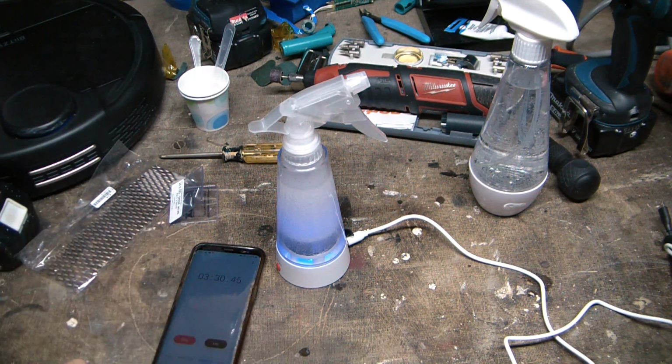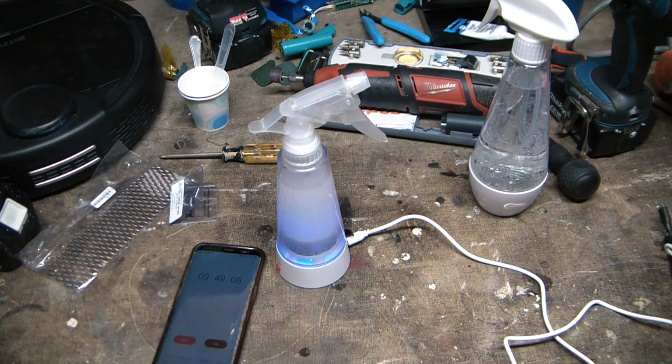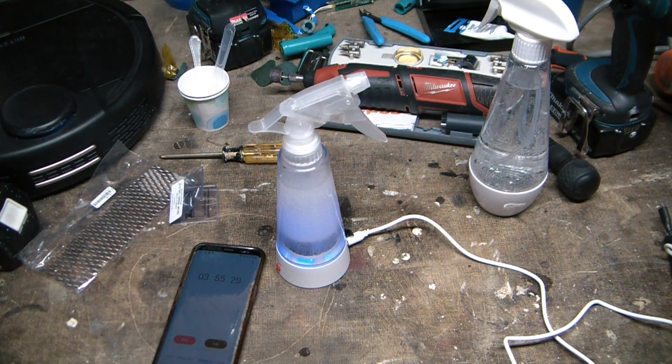I would say could also be platinum, or that's really all that would really work there. Mixed metal oxide or platinum. I'm sure there's some other exotic materials that would probably work for a short time, but those are the 2 that would really do it. Obviously they're not going to use platinum, it's too expensive, so this by default has to be mixed metal oxide. It's also a black coating. Platinum would look like a dull gray.